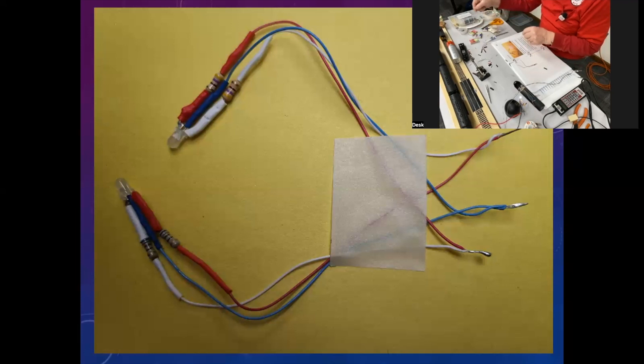After you've got your marriage done, wire the two assemblies together if you're doing both ends of your locomotive. Hook your blue together — blue to blue — and hook a red to a white and the other red to a white. That gives you the front and back of the locomotive. The one with the white wire going to the front should go to the white headlight wire of the locomotive — when going forward it lights up white, and at the same time current through the red wire lights up the other LED red. When you change direction, you've got white on the back and red on the front.